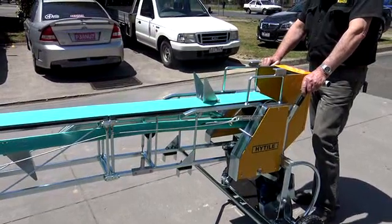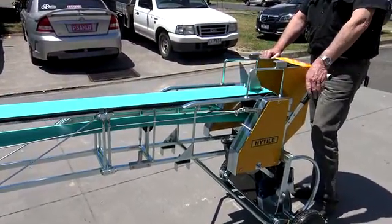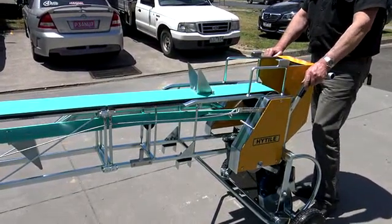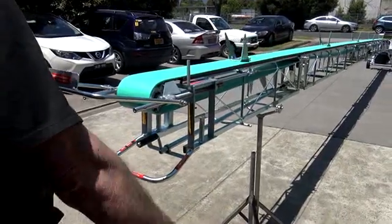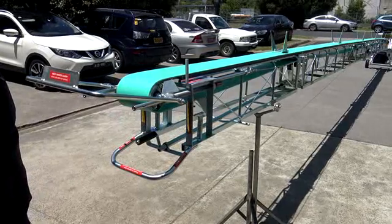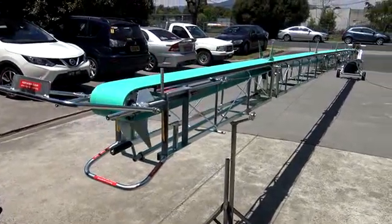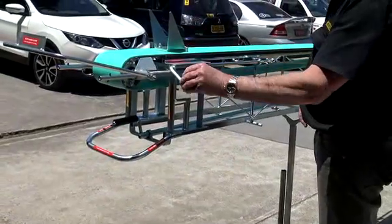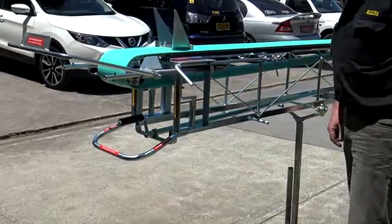By lifting the lever at the base, the V-belt is loosened and the main belt stops. This action at the top of the elevator prevents the tiles falling over the end of the unit if no one is available to lift off the load. It is also a safety stop if needed. This lever can be turned down if tiles are removed over the end of the unit.